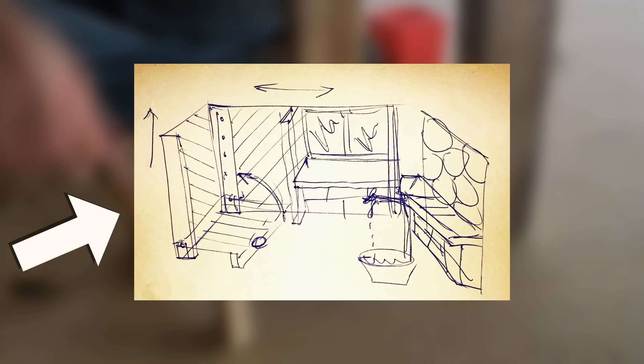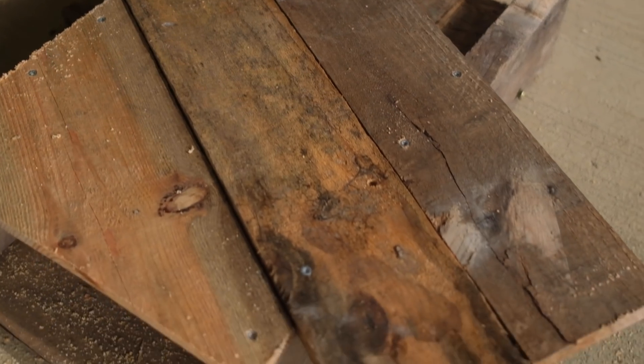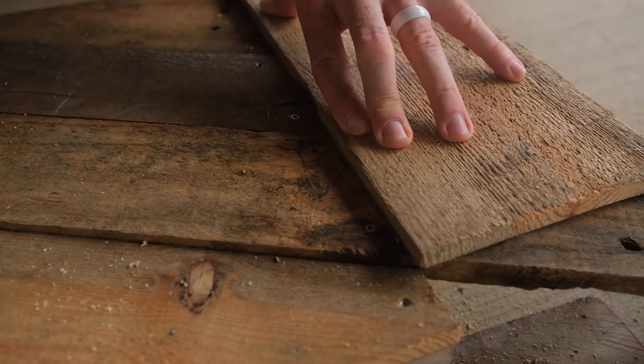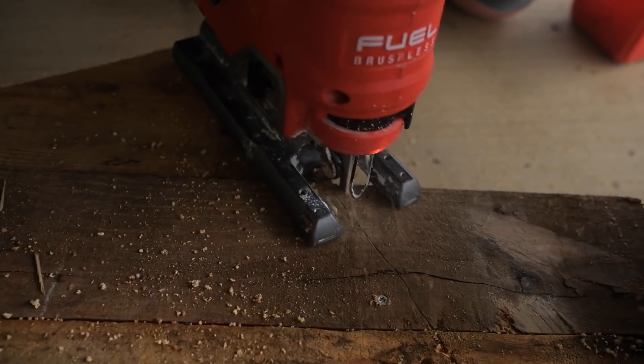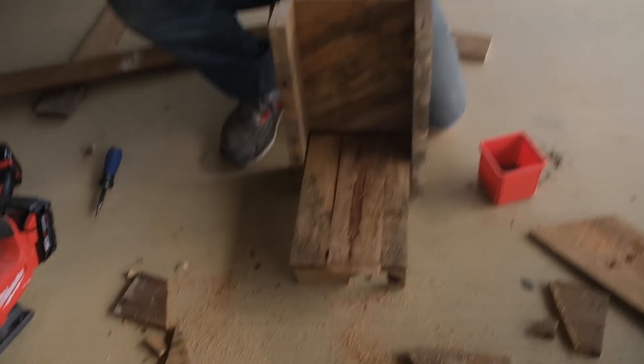To make this part a little extra fancy, what I want to do is have diagonal wall slats. All I'm going to do is lay my studs parallel, pick any random angle, lay them down, screw them in, and cut the ends off. Stand it up and see how it looks. There it is.